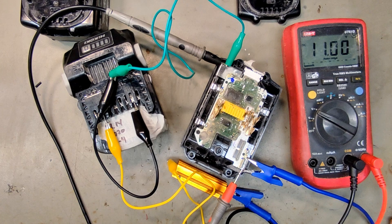We're now up to 11 volts. You need to get to about 14–15 volts before the battery can potentially charge in a regular charger. Doing it this slowly at low current is the safest way, and all you really need is a resistor and a multimeter — and the multimeter is to read the cells before you do anything silly.